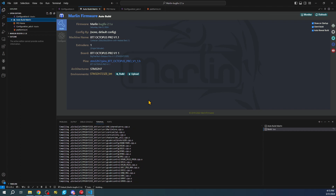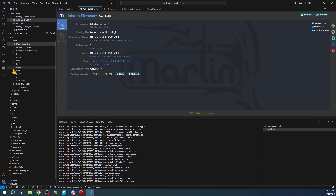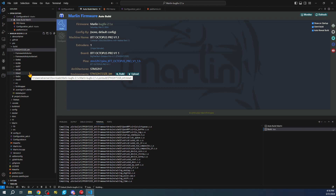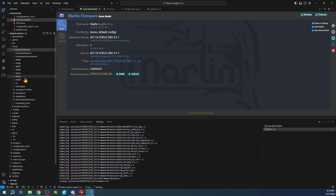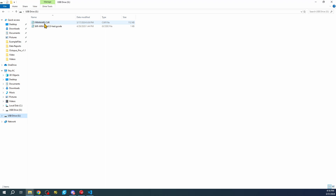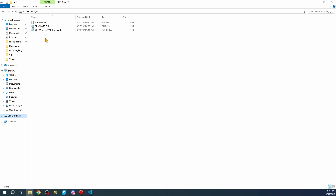Now that we're almost done building, we can learn from this. If we scroll up and go to .pio then the build folder, it will populate. Inside here you'll see firmware.elf and then firmware.bin - that's the file we're going to work with. We'll right-click and go to Reveal in File Explorer.